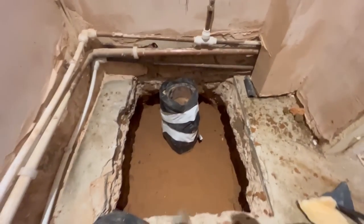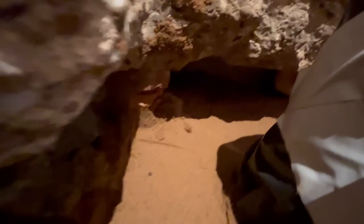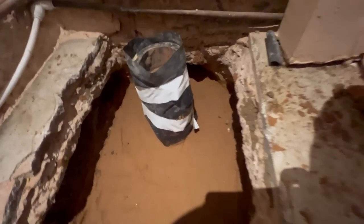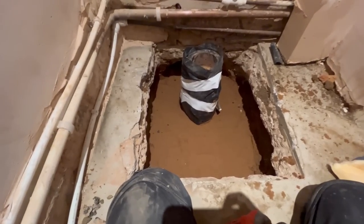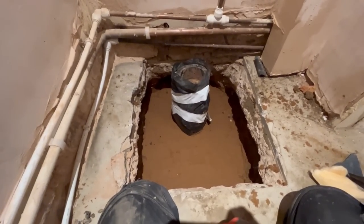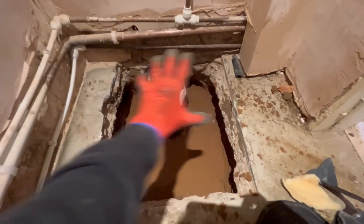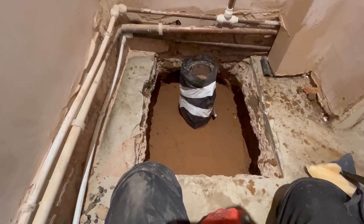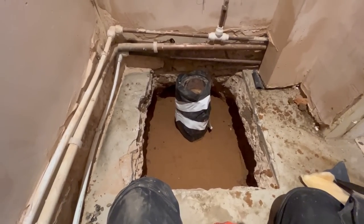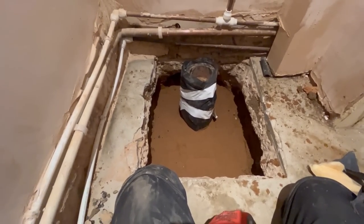And then what I'll do is we'll concrete so it flows under there, goes under there, and supports all of this. And we'll fill this up with concrete now. There is about, I'd probably say eight or nine inches, 200 mil, 225 mil of concrete there. And we'll fill it up with concrete just to make sure all this is bonded in again. That's what we'll do. And I think that's the best route to go down. Don't you, Mick? I do. There we go then. That's what we think, and we're happy to accept your comments on that one.